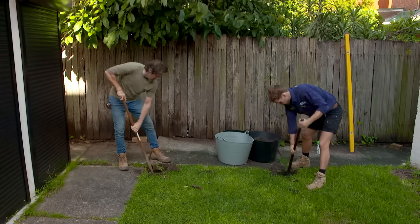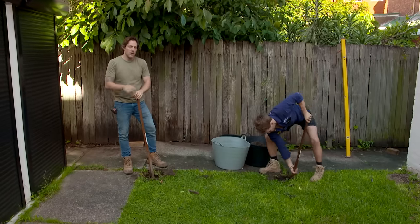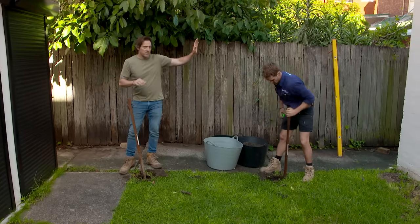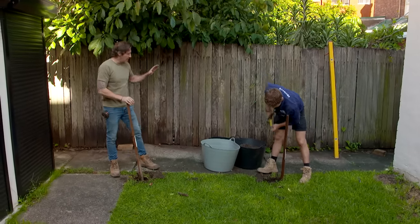To get rid of our bins, I'm going to be building a screen. I want something quite tall, about 1.8 metres. So I need to go into the ground one-third of that, so I'm digging a hole that's 600mm. We're going to put in two posts, bolt one to the wall, then we can put some slats in and some vertical blackbutt screening. Not only is this going to hide the bins, but any other junk in the garden is going to be kept behind here as well. That way, when you're in the garden, you get a lovely peaceful setting.